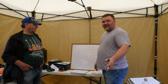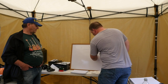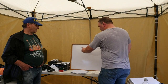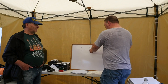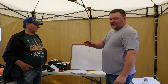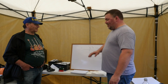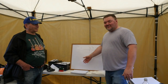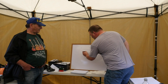Some of you may be familiar with off-center fed — a Windom, a Carolina Windom. What they do is feed it not at center but about one-third to two-thirds along the wire. Same amount of wire for the most part, but we're shifting the feed point. This length is about two-thirds, and this is about one-third of a wavelength at the feed. As we move from center, our impedance changes. This is still resonant — still a half-wave — but our impedance changes. As anyone who's taken a tech or general class knows, SWR is not the same as resonance. This is what we're talking about.